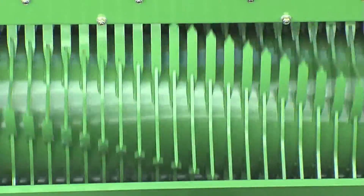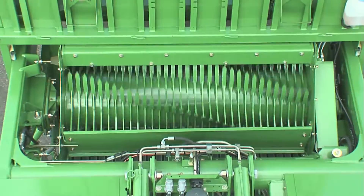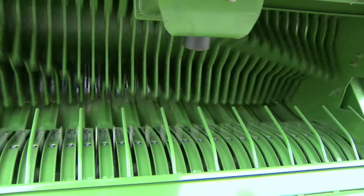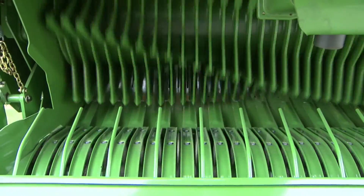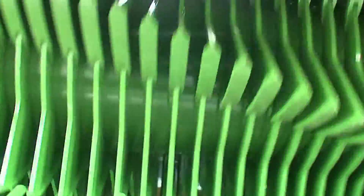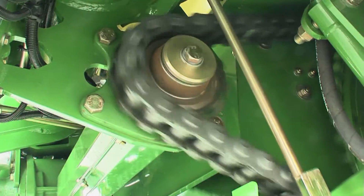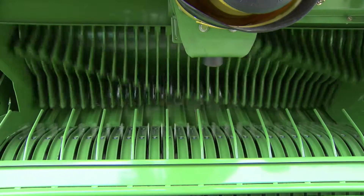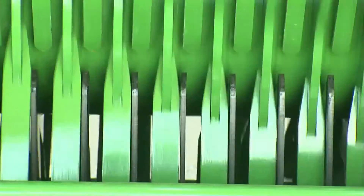Cutting to the best quality: featuring 1560mm wide and 760mm diameter rotors, the AX range of forage wagons can deliver extra high capacities. The cut and feed rotor is driven by a stronger 1.5 inch chain that copes with the highest loads. Tines, arranged in six helical rows, pull the material consistently through the knives.